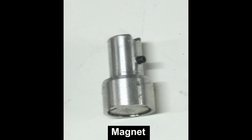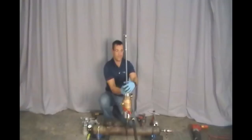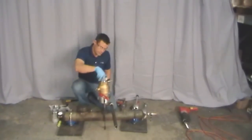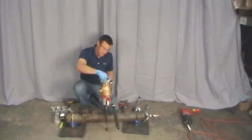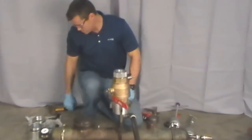In the unlikely event that the expander plug falls into the T or into the assembly, use the magnet attachment to remove the plug. Simply fit the magnet onto the expansion plug insertion removal tool and fasten to the ball valve. Open the ball valve and push down until it captures the expander plug. Fit the viewport and open the ball valve. Look to check the expander plug has been properly inserted into the throat of the T before progressing to the next step.